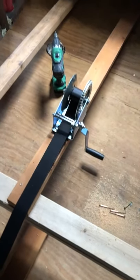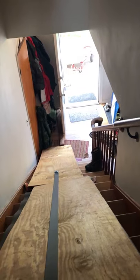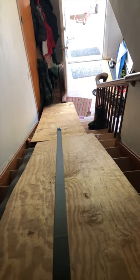Up in the bathroom, I've set up my winch to slowly ratchet the tub up so it doesn't slide back down and lose ground. I've created a little support system with some two-by-fours, reinforced the studs at the bottom so they don't move under pressure, and built a platform for the winch with clearance for the handle. It's going to go down the stairs on these ramps, and I'm going to manually get the tub close enough to hook it up, then slowly ratchet it up the stairs.